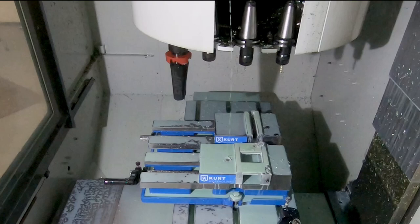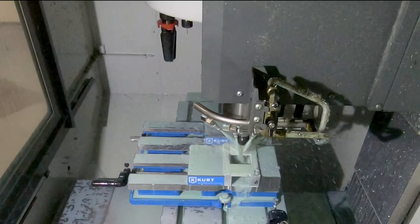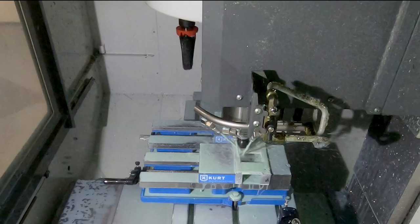1/4-inch 3-flute from Lakeshore Carbide, designed for aluminum, works exceptionally well, and it is doing the pocketing operation. This is the rough operation, and it does it pretty quickly. Now shifting back to the little guy, the eighth inch two flute solid carbide milling cutter.